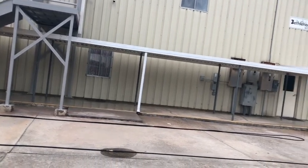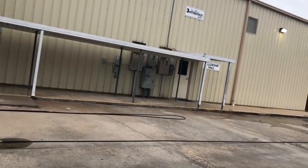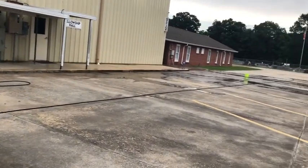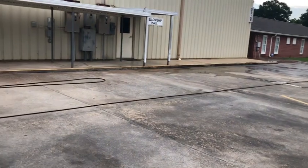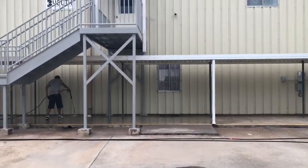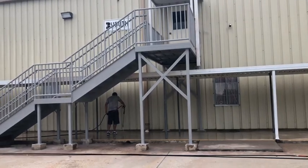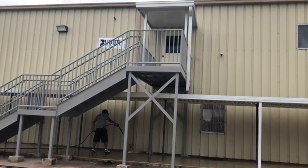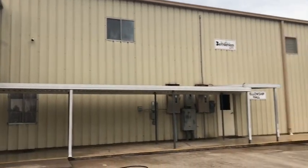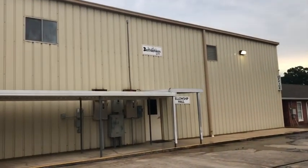We had 12.5% SH in the bucket. I counted it as 10% because it's been sitting out in the sun for a while. I mixed two gallons of the SH with three gallons of water, and then the X-Jet again splits it in half. I figured that would be about strong enough to remove everything — and it did. Looks like it's taken care of it.